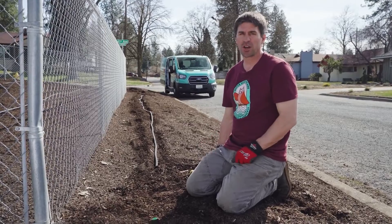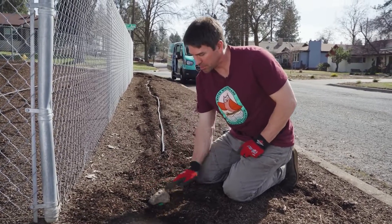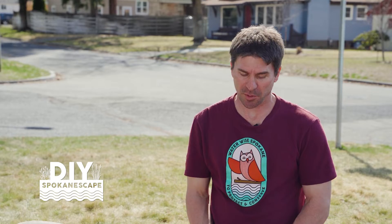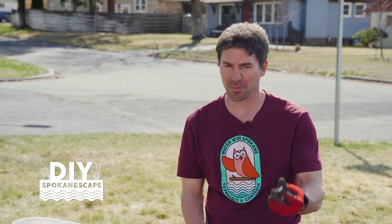Since this is kind of in a higher traffic area, you might want to think about setting a rock or something by it just to remind you where it's at, and if it gets stepped on, the rock will take the impact instead of the shutoff itself. Some people get intimidated by installing drip irrigation, but it's really quite simple — kind of like putting Legos together. You just put the pieces together that fit, put a clamp on it, and if it leaks, tighten it down and test it again until everything's leak-proof. And if it leaks a little bit, it might be right where you want it — just put a plant there.